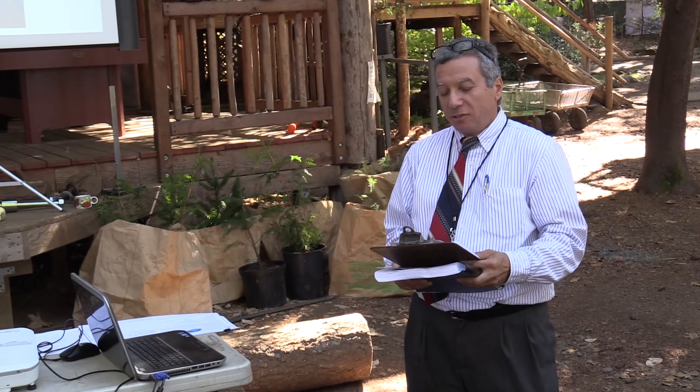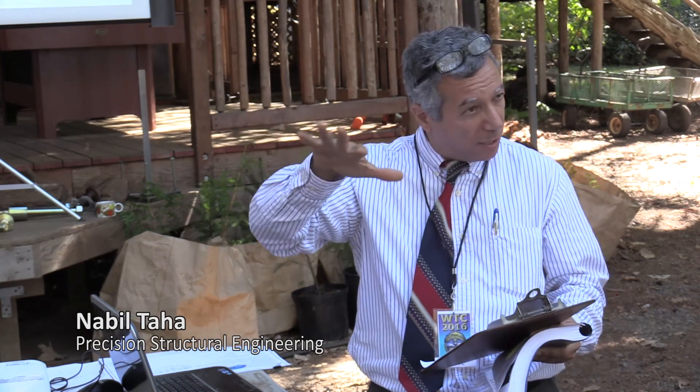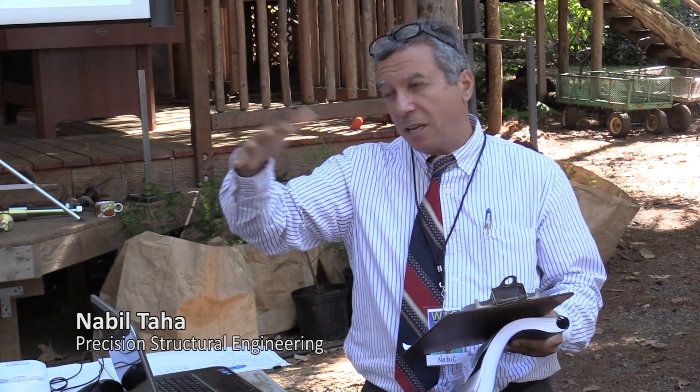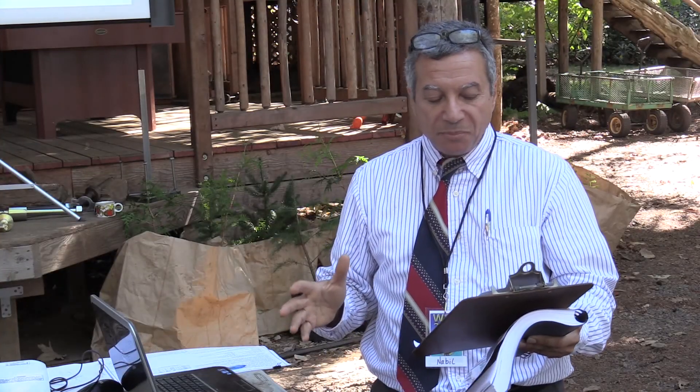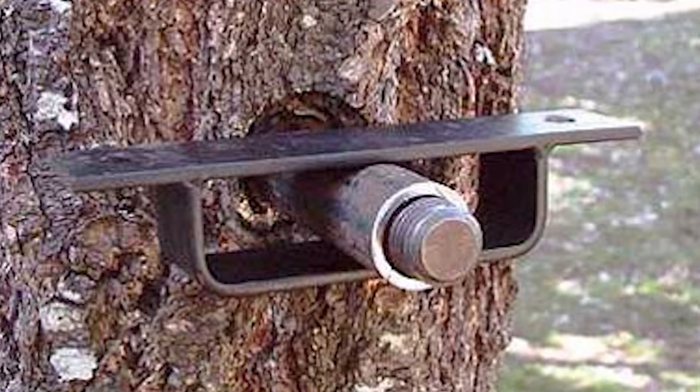Michael, thank you — wonderful speech. He's a smart guy, but please be careful before you apply what he mentioned, because not everyone has his experience. I'd like to add to what Michael said: we also have to add wind and seismic loads, which make the load no longer equal at the four bolts. It tends to increase in some areas and decrease in others. Also, tree movement — unless you allow for it — will cause very high stresses on the bolts.